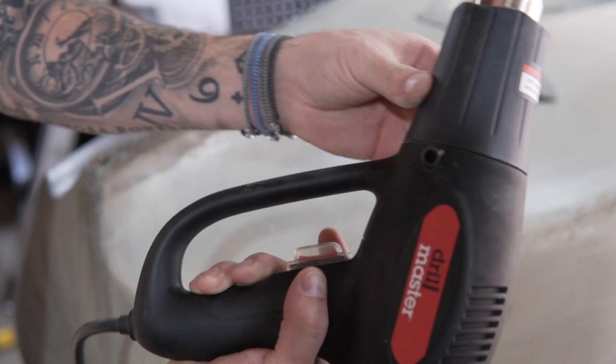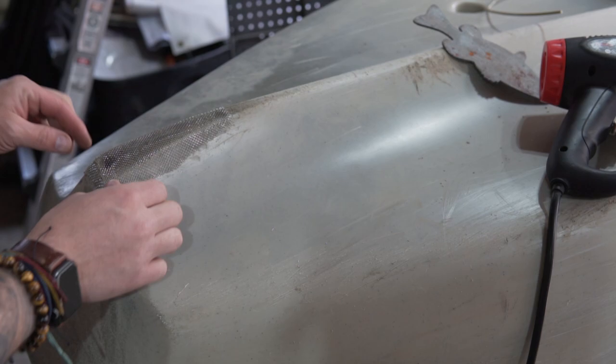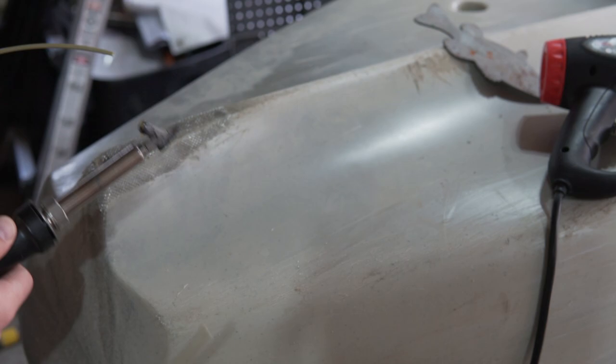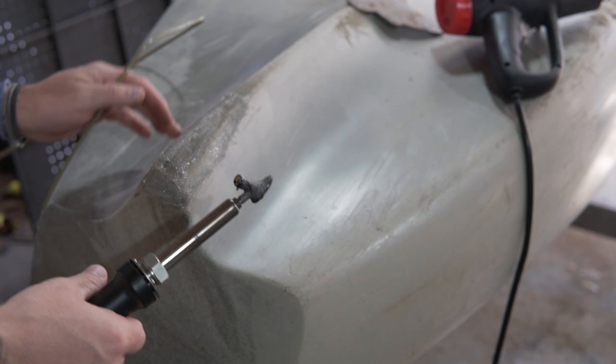Butter knife works good, putty knife works good, metal fish worked fine. Make sure you don't put the hot tip of this on the kayak — always have it not touching it. That looks good, you can see it's starting to take shape. So now I'm going to take my plastic welder and my stick of plastic and start building on top of this here, building a little bit more foundation up. Now that we've got a good base here, we'll start pushing this through — just feed it through like that.